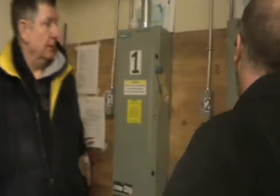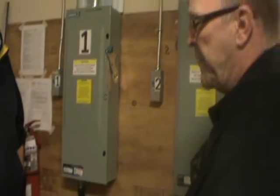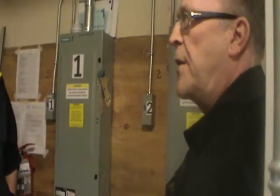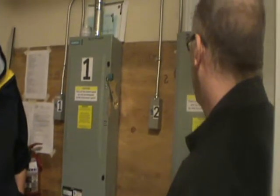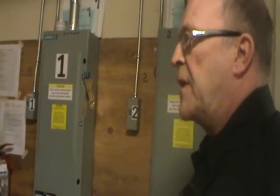The main switch — the only reason you may want to cycle it is if there's some kind of malfunction in the evening and you don't want to call somebody out. You could try turning the power off on the affected elevator, whether it's car one or car two. Often a car will return to service, and then a serviceman can come in the next morning. That's the only reason you'd really want to turn this off — you try to reset it, it just does a reboot. It does happen in isolated cases but shouldn't be done with any regularity.